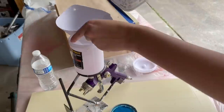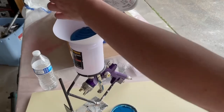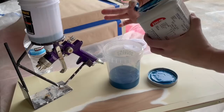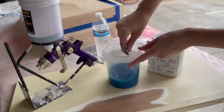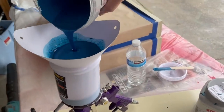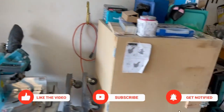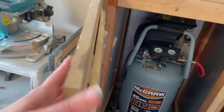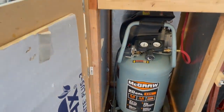Now on to the fun parts. For the body of the cabinet, my friend has chosen Loyal Blue by Sherwin-Williams. I'm using their chalk paint finish again, and this time I had a bit of trouble getting it through the paint strainer, so I mixed it up separately in a container with about 25 percent water — and voilà, it was perfect and ready to spray. I get tons of questions about our sprayer setup. I got the tank from Harbor Freight and I'll zoom in on the settings. It lives in its own little soundproof box so we don't bother our neighbors.